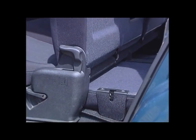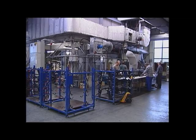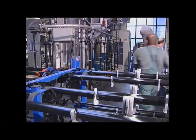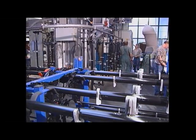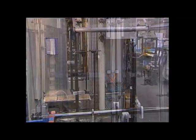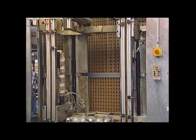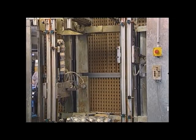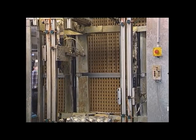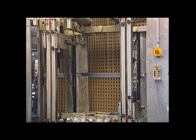Not only plastic parts are flocked, but also large steel parts — as seen here for seat fittings. These are supplied in special transport frames and the parts are taken out individually and placed into an automatic conveying system. Once they have reached the adhesive coating installation, the doors close automatically and the spray robot applies the adhesive with several automatic spray guns, with a sufficient coating thickness over the entire area to be flocked.